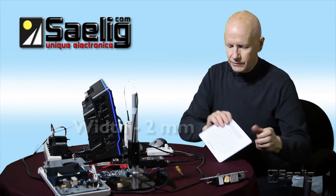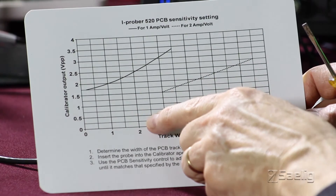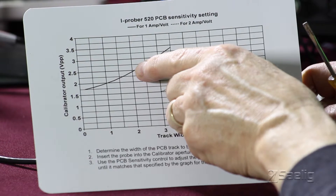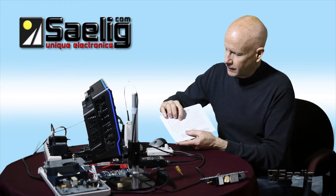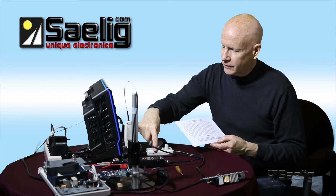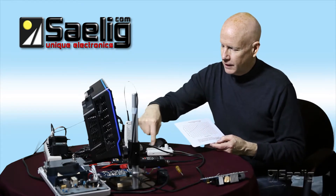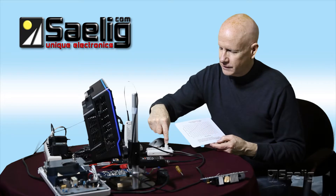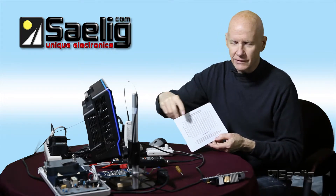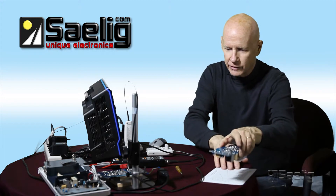So what you do is you refer to this card — it shows track width on the x-axis. You go up to two millimeters and it says you should calibrate this unit to something just under 2.5 volts peak to peak. There is a little calibrator well on the active interface box here. You put the probe tip in here and adjust the PCB sensitivity knob until you see approximately 2 to 2.5 volts peak to peak on your scope screen. Then your unit is all set up to work with that particular trace — that's really all there is to it.